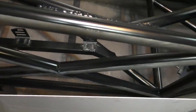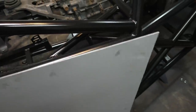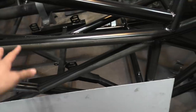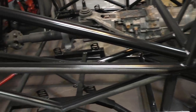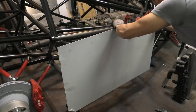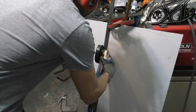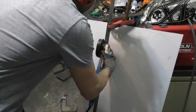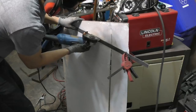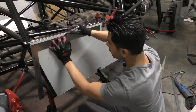Now I have to rivet on these aluminum panels that need to go on the side and some other places. It's going to be fairly easy — all I have to do is mark where to cut them, cut them to size, then drill a lot of holes for the rivets, and then glue and rivet them in place. For cutting, I just clamped them and used a marker to mark the cut positions, then used an angle grinder with a steel flat bar to cut in a straight line.